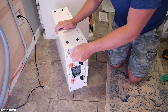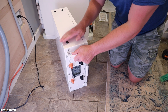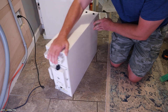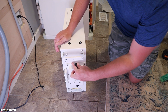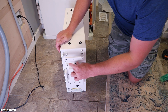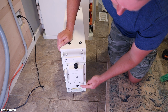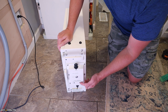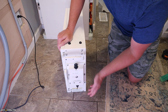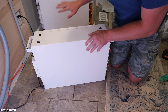There's also a handle up here which is very helpful. On the top you find these little rubber gaskets and those help the next battery in line to stay on top without moving around. On this other side you can see there is a screw terminal that will open up and allow the ethernet communication cord to go into. There's also one on the bottom for the next battery in line. There's a power button, a state of charge LED indicator, and in this little drawer you'll find the ID bits to tell the control board what number this battery is in the paralleled array. That's just the basics of the battery, so let's go ahead and get this installed.